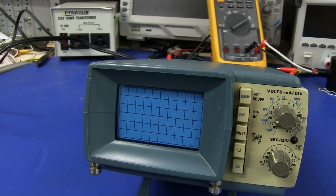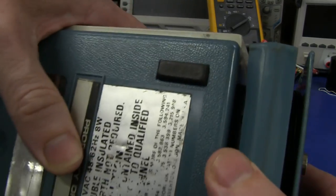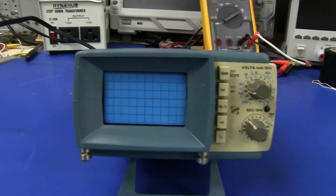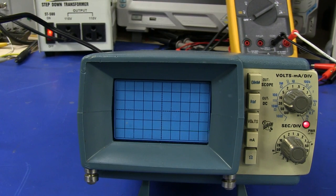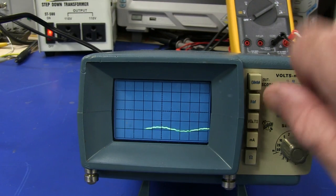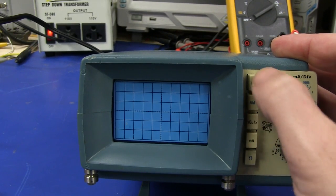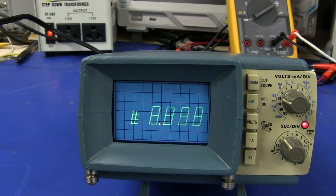We're going to power it up. I've got my 110 volt step-down transformer - this looks like it's 110 volt powered. It says it accepts 45 to 62 hertz, so it'll handle 50 hertz no problems. Here we go - let's stoke this thing up. And hopefully the magic smoke won't escape. Hey! Look! We have a trace! Beautiful! Oh, we're in Ohm's functionality. Hang on - DMM. They've got the readout as digits! That's fantastic!